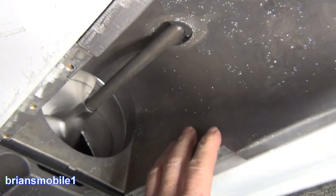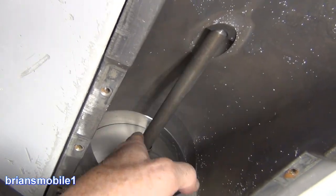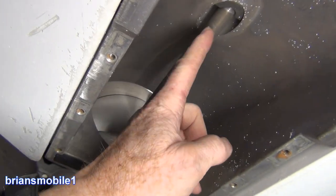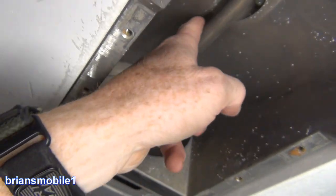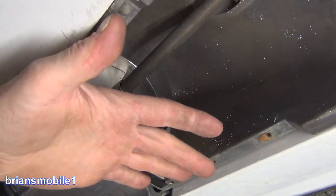If you can't remove the grill, the best thing to do is take a fillet knife and cut down along the edge of the shaft — just like a sharpening rod — and cut along the rope. If you try to cut the rope straight on, you'll find that your knife gets dulled really quickly and it takes a long time. It doesn't work very well. But if you go over the top of it like a tangent line on a circle, you'll find that you can cut the rope off really easily. If you can't get the grill off, your best bet is to cut the rope off.